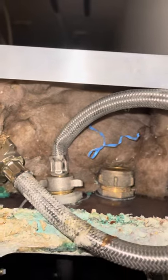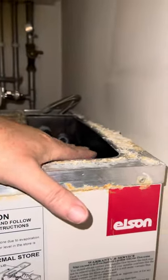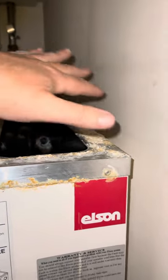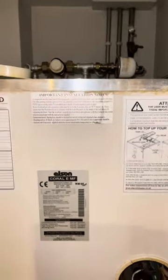The difference is, if I put my finger through it, it's actually capped off. So what would happen in an emergency is: as the tank overheats due to failings on the cylinder, the water will rise and rise, it can't escape through there because they've blocked it off, and it will just overflow and flood the place.